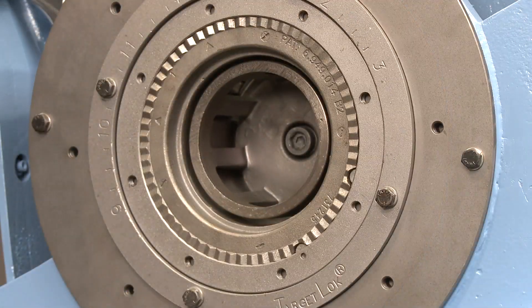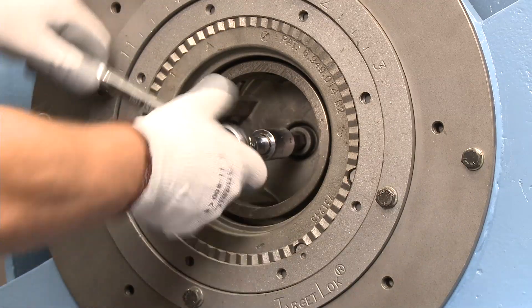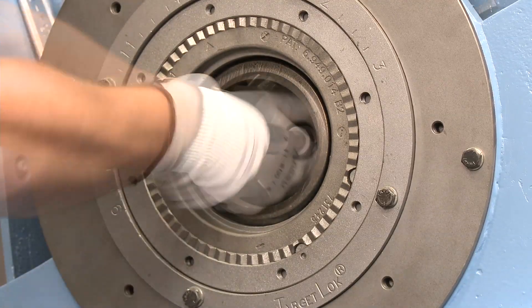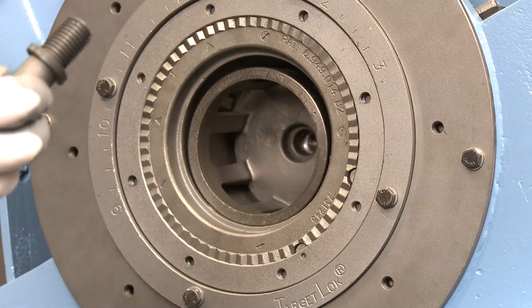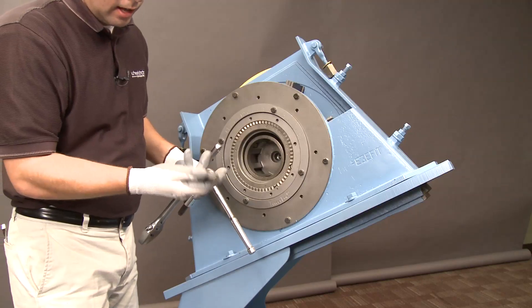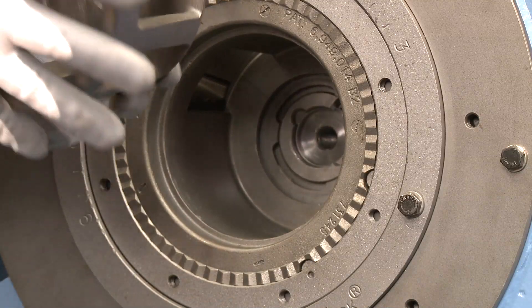You may wish to put a crescent wrench on your blade so that you can rotate it and handle it as you undo the impeller bolt. Remove the impeller bolt — you may need to blow out the threads with compressed air. Then, remove the impeller.